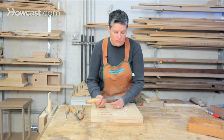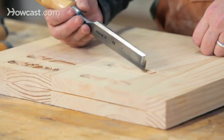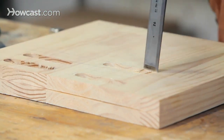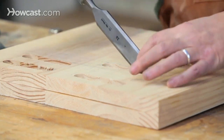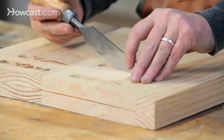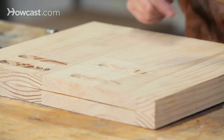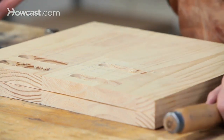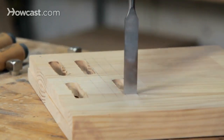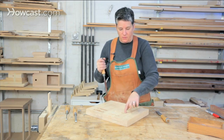In a joint like this, we're going to have to use the chisel to set some guidelines. The technique for doing that is to take a big chisel — one with a lot of surface area — place it on the inside wall of the mortise, and just tip it up. It will carry that line of your mortise wall to the top of the wood. Basically, I'm trying to create an extension of the wall of my mortise past this curve so that I can have a place to cut into it. We'll also have to do the same on the back to create a straight edge along the back wall. Here I'm just using hand pressure — I don't need to use the mallet for this; I'm just going to create my lines.